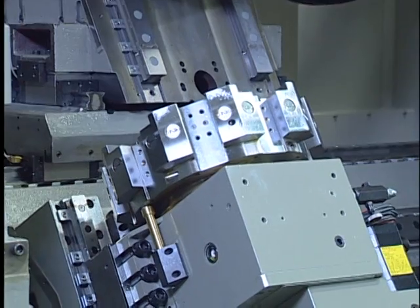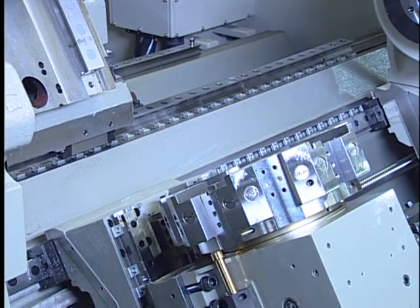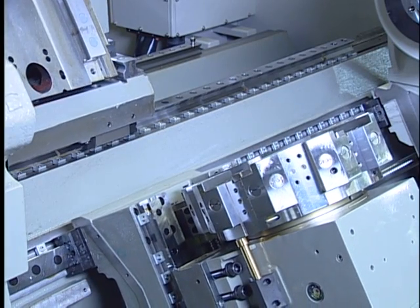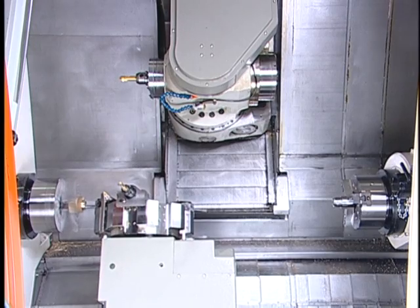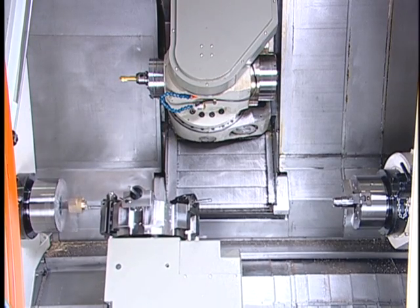Innovative 9-station turret minimizes possible uncommanded cutting by the opposite tool so as to allow more turning range. Servo-driven turret used for twin spindles features quickest tool indexing and easy maintenance.